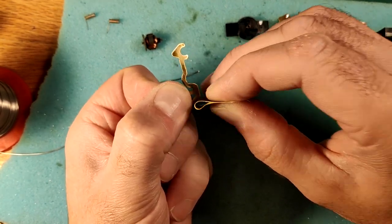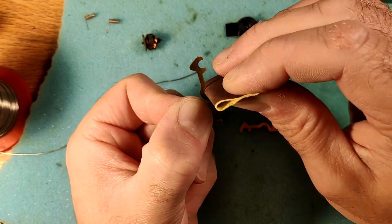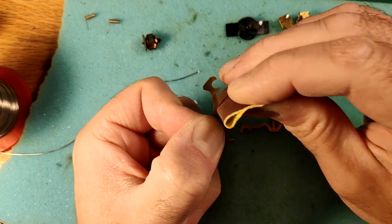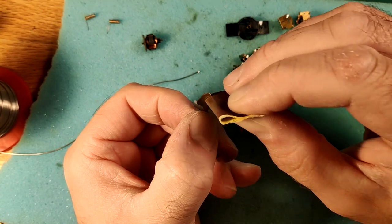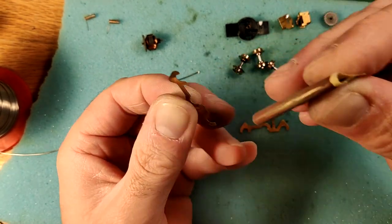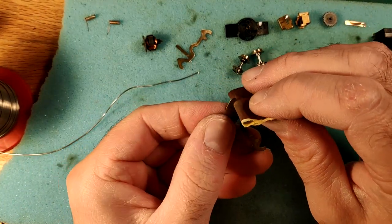You just want those areas quite clean, and even though it's been degreased, the IPA won't get the tarnish off the brass. That's the best way I can explain it. Whereas this definitely does. And this probably then translates more into how it was brand new.